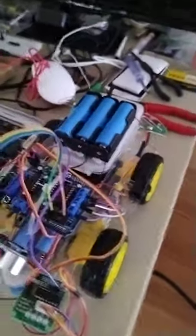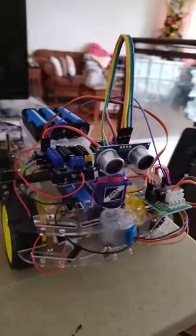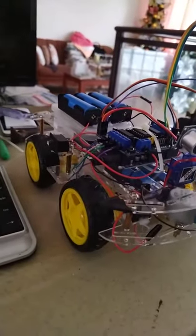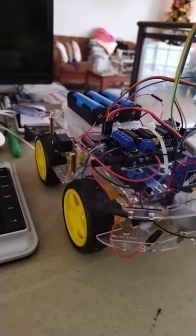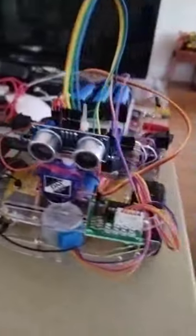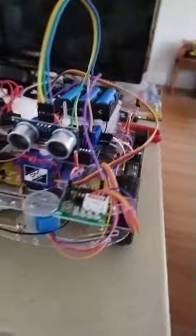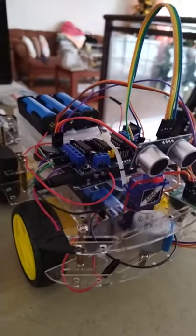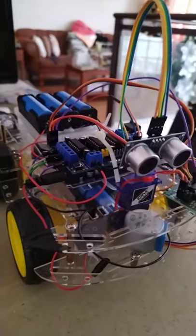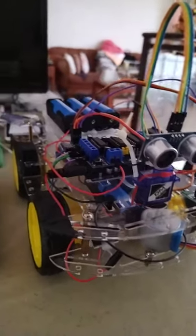I will see and I will post in my next video how this cleaning robot will work. Basically, my L293D DC motor controller will drive these four wheels — so this is a four-wheel driven cleaning robot. I have a separate power supply for my DC motor module and another power supply for my Arduino.